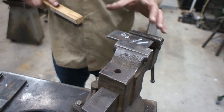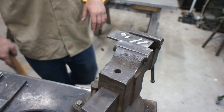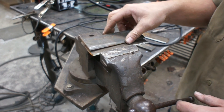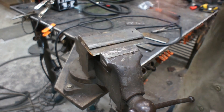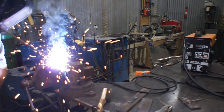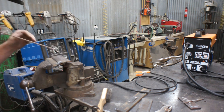Now these beads are a little bit cold, and the machine is set on its maximum output currently. So a quarter inch is probably a little bit much for this — three-sixteenths plate. This is just some old dirty plate I pulled out of the scrap bin, and I'm not even going to clean it. Let's see if we can get these to weld together. You can see we didn't even bother to clean the mill scale off this.